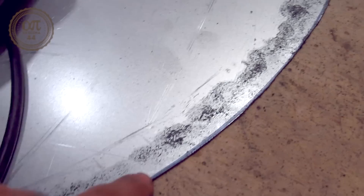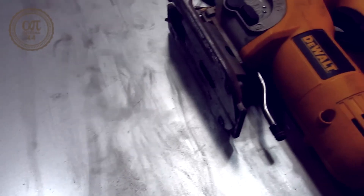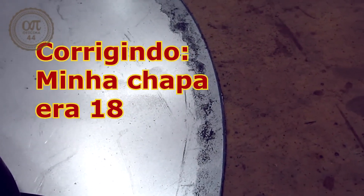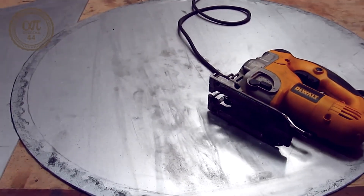As you can see, the cuts turned out pretty well despite some flaws where I went a little off track, partly due to the cutting position. The idea was to give you a general notion of the work as a whole. For thin sheets — this is a gauge 16 sheet — if it were a gauge 24 plate, the ideal would be to line it with 3mm MDF and cut together to prevent the sheet from bending. Okay guys, that's it! I hope you enjoyed it and that it helps you. We'll be back soon with more videos — a hug to everyone, see you next time, bye!